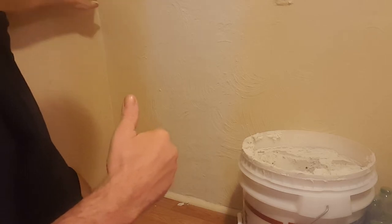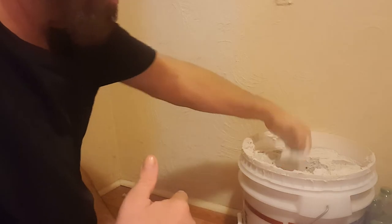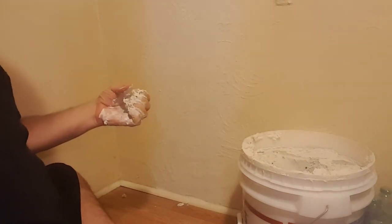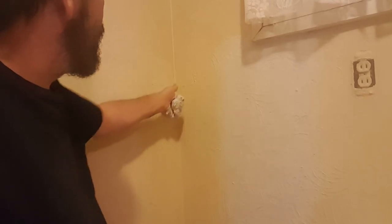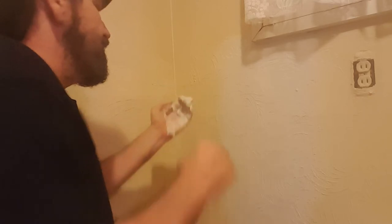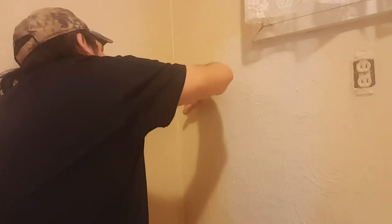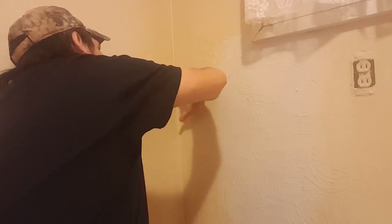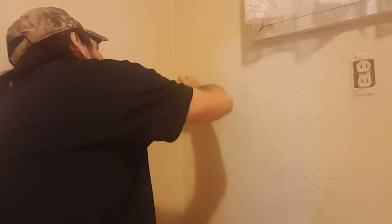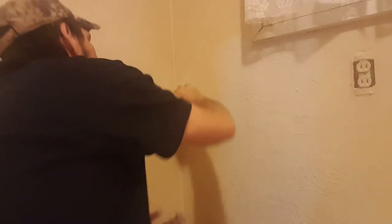While I'm at it I think I'm going to fix these little holes and lines over here. I don't know how well this will show up on camera, but there are a couple of lines here — it looks like maybe I put my kitchen table there before it was completely dry. So I'll take a little bit of texturing and fill those in the best I can while following the pattern that's above and below it. That one's gone, but I still see it a little bit.